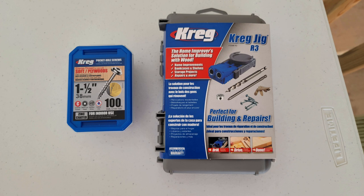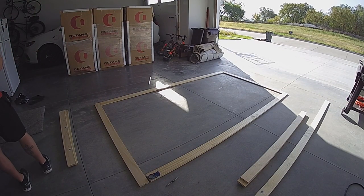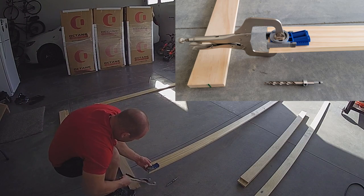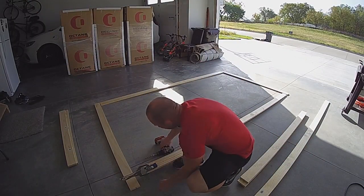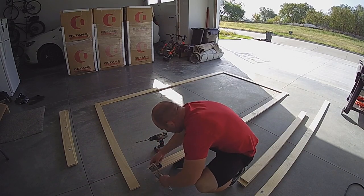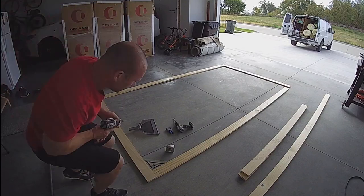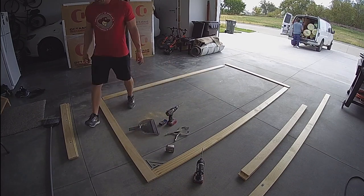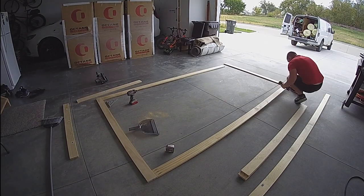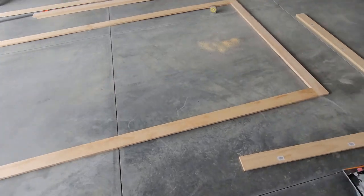Here is the Kreg jig. I have never used one of these before this project. It was relatively easy to use and was perfect in this application. There are several Kreg jigs available, and knowing I don't use them very often, I opted to get a cheaper version, which honestly still worked really well for me. After setting everything up, you clamp the jig to the end and you drill your holes using the supplied drill bit. When you're done, you have some really nice pocket holes to attach your corners together with, creating a seamless, strong connection. I opted to do three holes for each corner. The wood I used here are 1x4s, so there was plenty of room. Then, using the correct length Kreg screws, you simply line up your corners and screw them together.